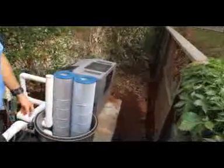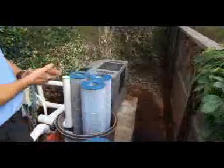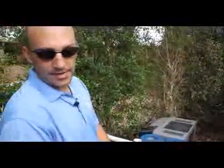Once you have completed that, take a water hose and spray the remainder of the debris that's in the bottom of the filter tank out the drain plug hole. Now in the first week, you're going to have to clean the filter every other day. You'll also be brushing the pool interior finish a minimum of twice a day — you can brush it as much as you want, but a minimum of twice a day for the first week.